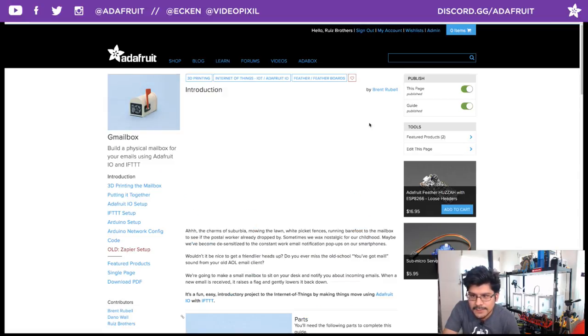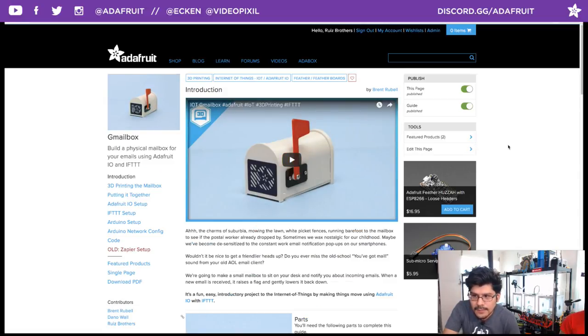Somebody was asking why not a 32 instead. That's a good question. Is code for both of those on there? I just skimmed the guide real quick, and noticed the code will work with any of the ESP8266s, as they can all use the same libraries. This is the same module. The Feather one, though, I think just has certain GPIOs broken out. So read the docs to make sure.